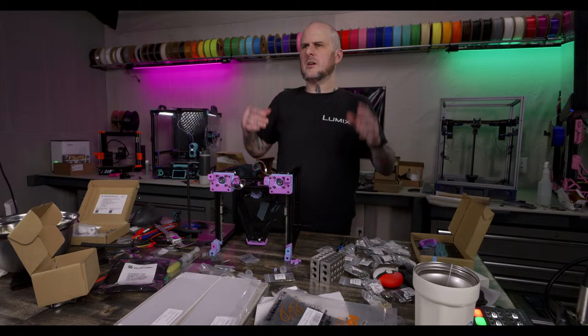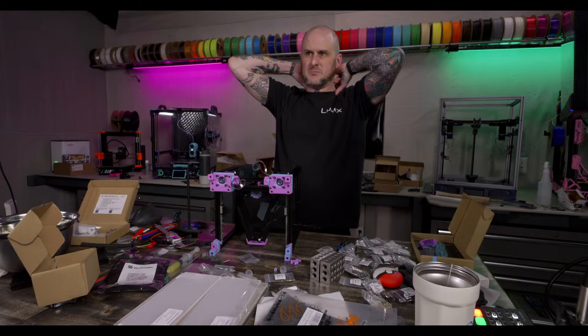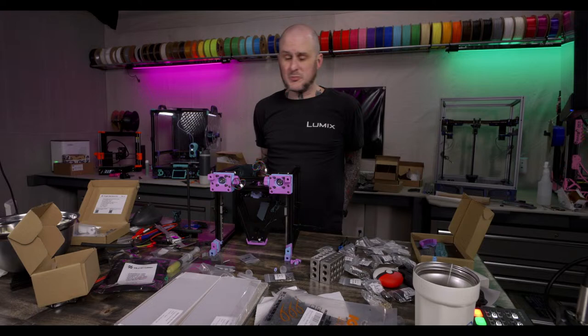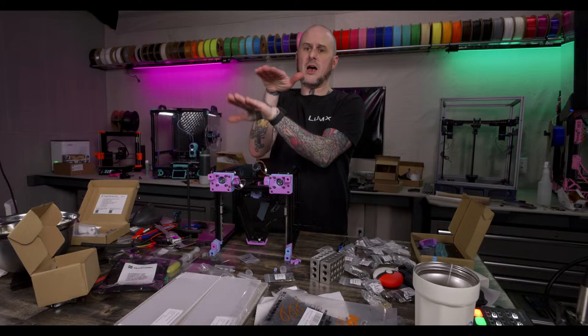Looking for a quality build plate to replace your warped 2.4 bed? I really like Precise Printer Parts. Precise Printer Parts is my personal favorite. That's what I've got in my 2.4, my 0.1, my Mercury 1, all have Precise Printer Parts beds. They're nice and flat, and they also have screws in the back of them, M3 screws, that your build plate butts against to help align it.